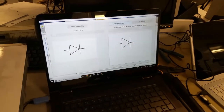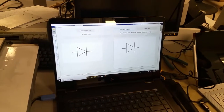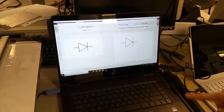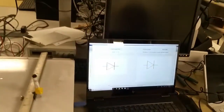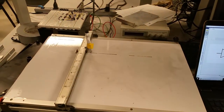And you're doing analog lines, right? You're doing smooth lines. That's right. So some image like line recreators will step in X and Y directions incrementally to recreate angles, but we do smooth lines by using some relation between the X and Y motor speeds. So now I can send this data over UART, and our plotter starts to draw the image.